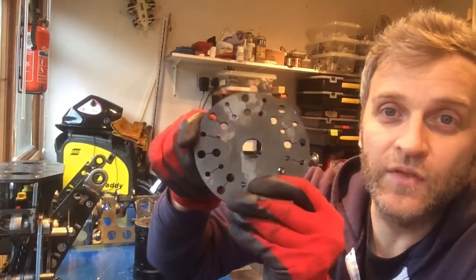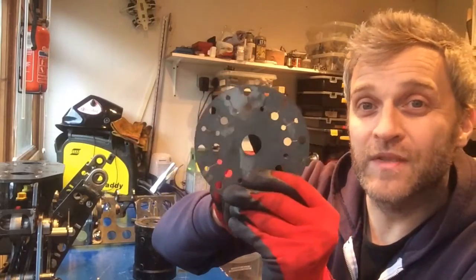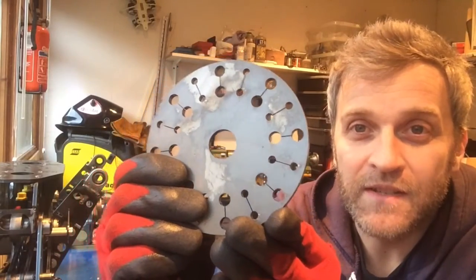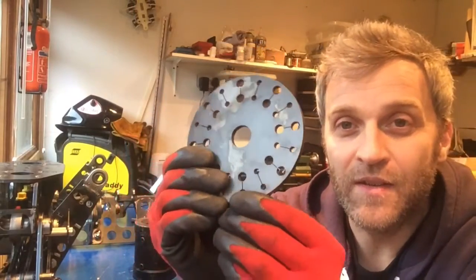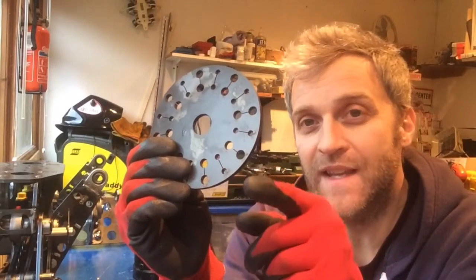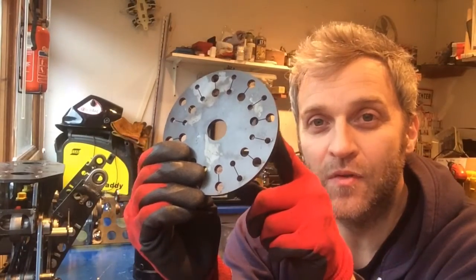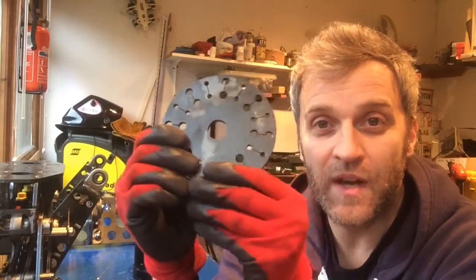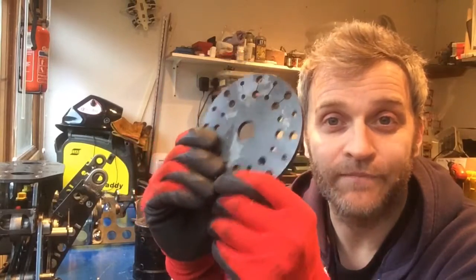The reason I'm showing this is to share a tip for online laser cutting quoting systems, which I think are really good. You'll notice I've joined all the holes up with slits between them - that's because laser cutting pricing is based not only on part size and material, but also on how many piercings the laser has to make. By joining the holes, it's half the number of piercings - the laser goes in through one hole, does that hole, travels to the next, and finishes it without lifting. Joining all those holes roughly halved the price of the part. A useful tip if you can do it!